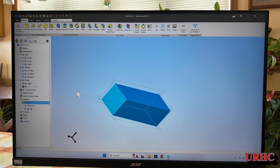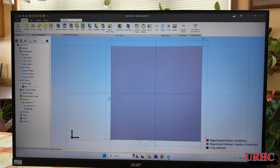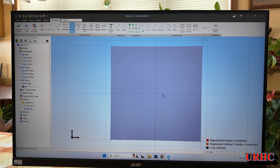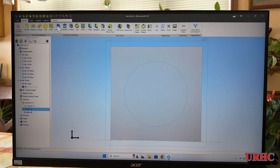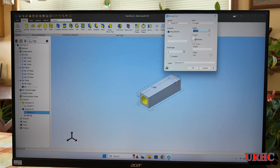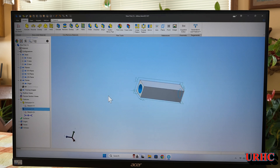Really simple, sketch-driven, easy to use — I find I'm really comfortable with it. Let's put another sketch on the end of that with a circle, exit the sketch, and then do whatever we want with it. Let's start by putting a hole all the way through this piece — just go up there and say 'through all.' That round circle puts a hole right through the piece.